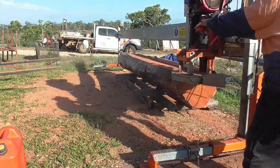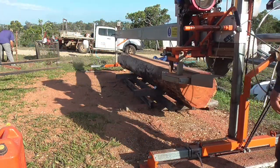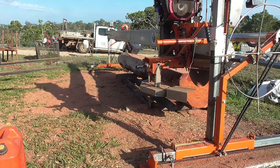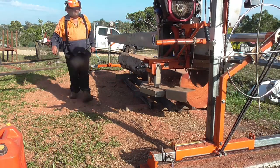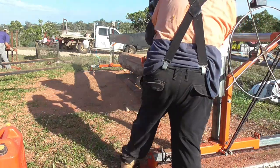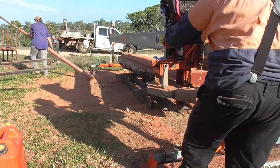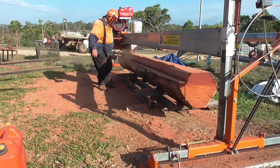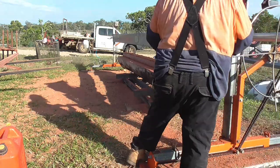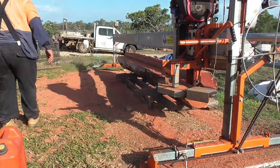When you're first making your initial cuts into your log you'll often get some pieces that are a bit odd shaped. But quite often out of them — like here we're trying to cut 4 inch by 2 inch, or 100mm by 50mm — you'll get pieces that are actually okay to use, like for noggins in building or shorter pieces. So don't just throw them all away. You can see now we've just started to get proper 4x2s and we're stacking them up on the loader, which is placed strategically so it's all really easy to do.